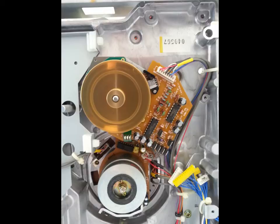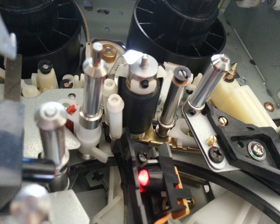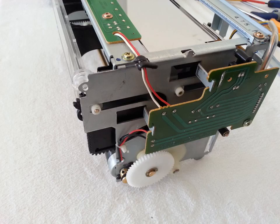You do have to have a lot of parts if you're working on vintage 3-quarter and broadcast machines. Sometimes you have to fix electronic cards if they've got cracks in the boards, or replace capacitors on the entire machine. A lot of these newer machines, you don't have to worry about changing out capacitors — it usually only affects machines that are around 40 years old, like reel-to-reel video machines, open 1-inch machines, and quad machines, where capacitors dry up from storage. For U-Matic machines and various other newer decks from the late 80s and 90s, you don't have to recap the whole machine — usually just a general area of caps. A lot of people ask me if you have to recap every machine you work on; no, you do not. Only old machines need recapping, not ones from the 80s and 90s, since those capacitors were meant to hold out much longer.